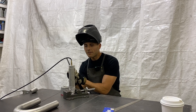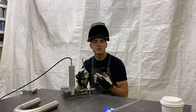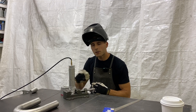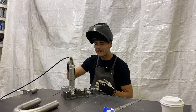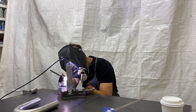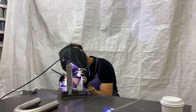The other thing is you want to evenly space your start and stops when welding a tube. So I always come up with a 15 count, a 12 count, or a 20 count, depending on the OD of the tube or what kind of joint it is. In this case, we're going to shoot for 20 dips so that you can see where you start and stop because there'll be a heat line and the weld will look just a little different. I like to count so we can keep all those start and stops looking consistent. Max pedal — one, two, three... all the way to 20.